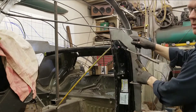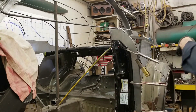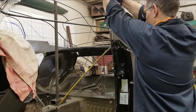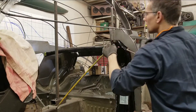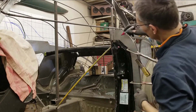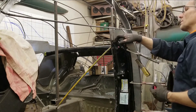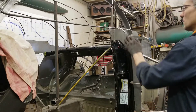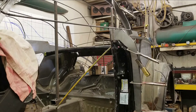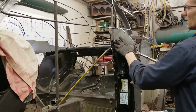The reason I'm overlapping this jamb here is to create more strength within the post. I'm noticing I want to do a little massaging with this metal here and bring the two surfaces together a little bit better — there's a bit of a gap up at the top. Let's get some screws into this. I'm pretty happy with where this is going to be sitting. Once I have this screwed in place, we can go and massage this to get it sitting in properly.